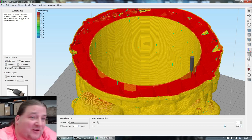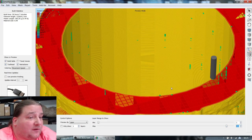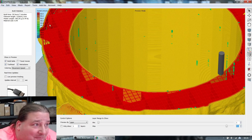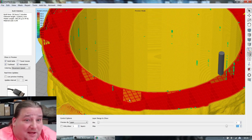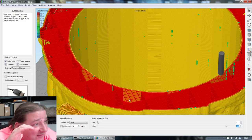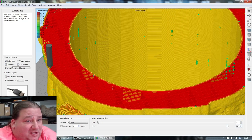Here we are at 5% infill, and then the next layer switches to 25%. It's going to bridge all that infill, but because the bridge isn't spanning the entire gap — just bridging from the 5% infill points — you'll have pretty good success. About 80% will complete properly, and by three or four layers of 25% infill it'll be 100% complete. That's why I switch from 5% to 25% — so the bridging mess happens inside the model where you can't see it.